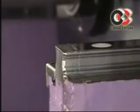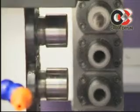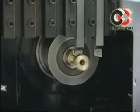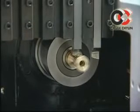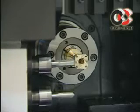CY25M adopts high-rigidity linear guideway imported from Germany with high-precision ball screw rod, servo motor, and PC-based controller. It has X, Y, Z, and C-axis fitted with cross-side and front-side turning tool devices.